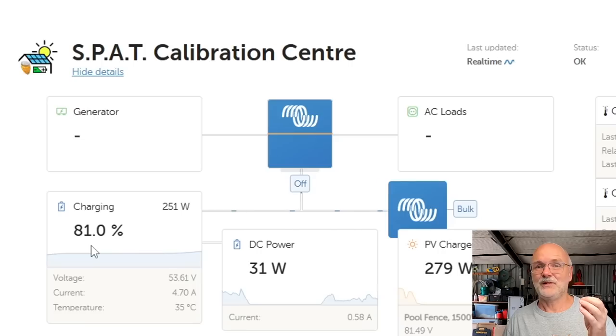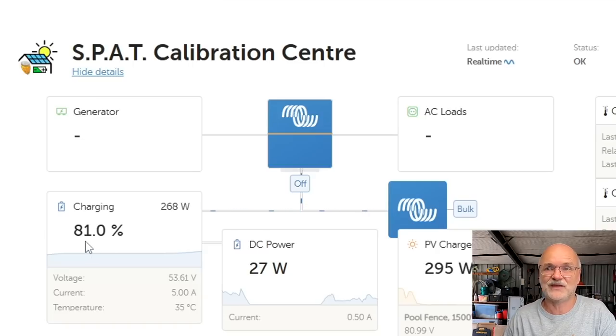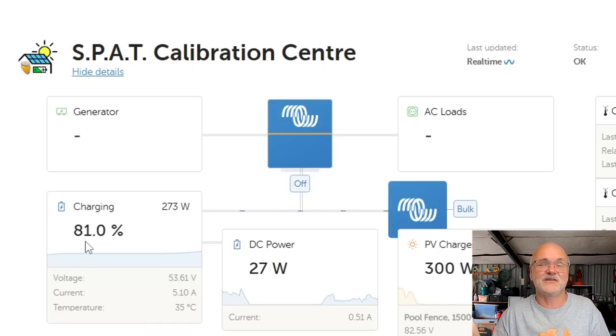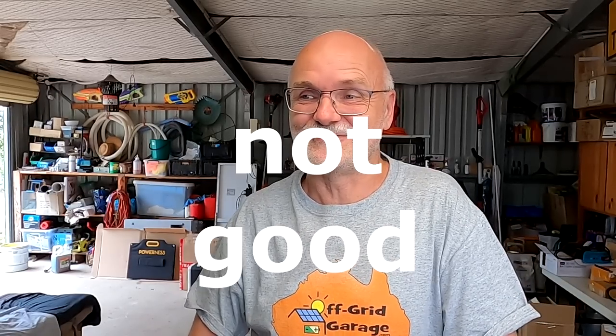State of charge is one of our main criteria here - it's the first thing I check when I open the VRM or any device in the garage. If this is 10% off and never reaches 100%, how am I supposed to know if the battery is at 90% or has actually reached 100% but just doesn't show it? Total shitshow. So this is not the solution either. We've done all the testing: turned off DVCC, turned it on, used the BMS only as a battery monitor with Victron controlling via solar charge controller. None of this is good.